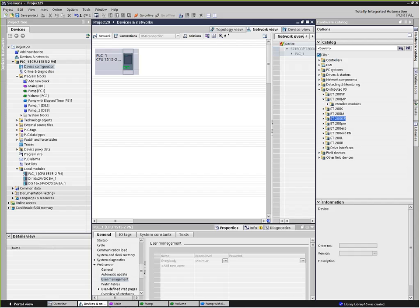The two latest entries to the Siemens line are the SP and the MP versions. Those of you familiar with the 200S, which was kind of a slice-based I/O, and then the 200M, which was the actual S7-300 based I/O, this is along the same form factors. The SP is a higher density version of the 200S, and the MP is using the 1500 I/O as remote I/O. We have Profinet or Profibus options.